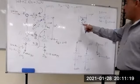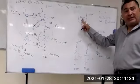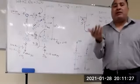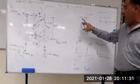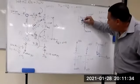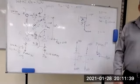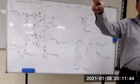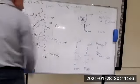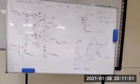Same here, same force now. I already calculated it. Then the horizontal decomposition in this direction, you must have force itself in this direction. I want to calculate FAD. If the horizontal is in this direction, for sure 100% the vertical is in this direction as well. So put your finger here, it's pulling, you have tension. Analogically, this member is compression, compression tension. Why? To make balance.